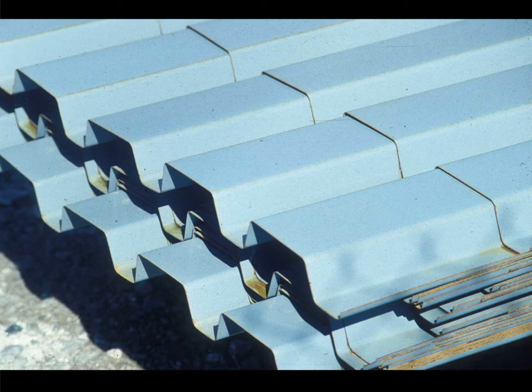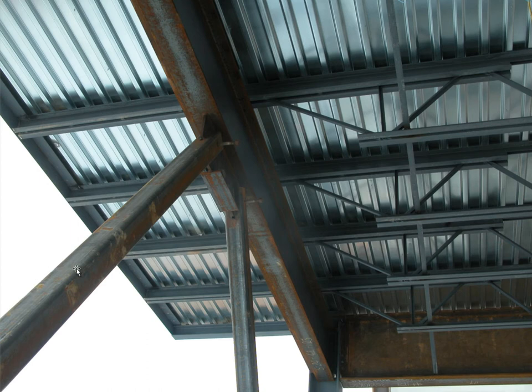This shows an installed version of the decking spanning across roof trusses, with top chord extensions going out to support the overhang. This decking can span in the direction of its corrugations — it cannot span perpendicular to them; it's super weak and rubbery in that direction. There's a need to support it all the way to the edge, which typically has a turned-up angle providing additional stiffening and a way to mount fascia elements subjected to wind.